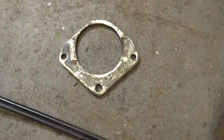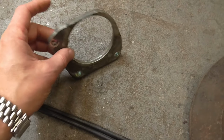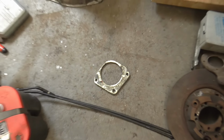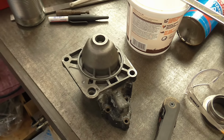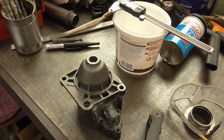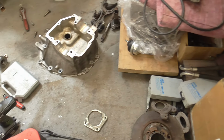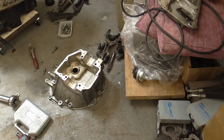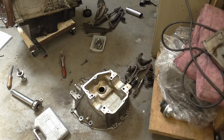Some holes have been elongated. This hole does not match the hole in the register on the starter motor casing. This is a 3-inch diameter register, 76.1mm. Quite why it's an inch dimension, who knows, but apparently it is. And yeah, this may be an original Alpha plate, but it's perhaps that circle has been modified to get everything to bolt in place.